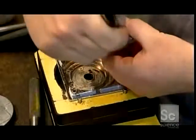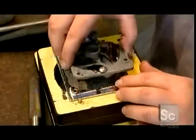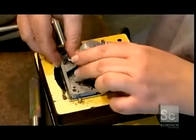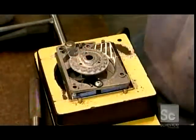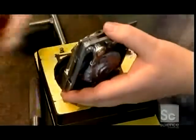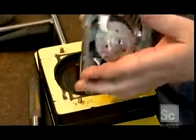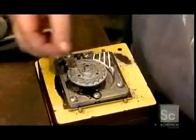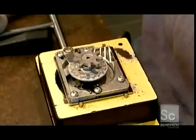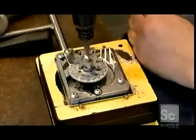A worker now assembles the coin mechanism, layering the front plate, the coin carrier, the back plate, and ending with a cam, the part that ensures the coin mechanism moves clockwise. She screws it tightly together, then inserts the handle on the front plate. The handle will turn the coins that pay for the gumballs. She places a little spacer and drive gear on the handle stem that protrudes through the back of the assembly, and then screws the drive gear onto the handle stem.